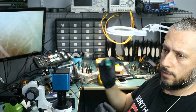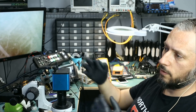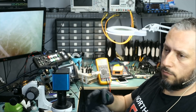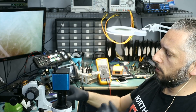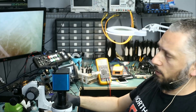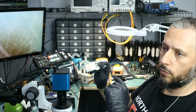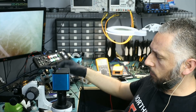I want to be able to plug this testing board — whether USB-C, micro USB, or lightning — into any device, write down the numbers of a good working device, and then compare them next time we get that device to build a pattern and make the repair process a lot easier. I'm also thinking we should have a database of good readings for every device we work on, so people can log in, read the numbers, compare them, and see what a reading should be if it's related to a specific chip or problem. I'm going to work on this other board next, replacing the M92 chip, and we'll reference the 0.519 reading with a bad M92 chip — probably in the next video.